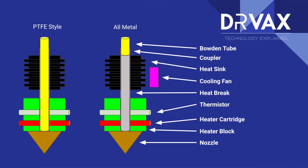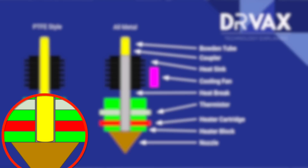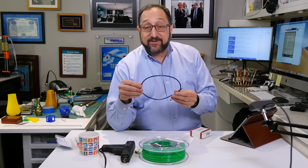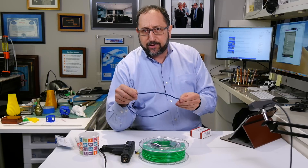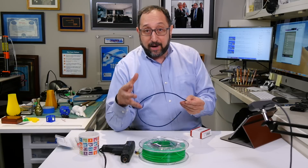There are two different styles of hot end. There's the PTFE style and the all-metal style. The PTFE style is the style used by most Creality printers — in that case, the Bowden tube goes all the way down to the nozzle. The challenge with that is if you don't press that Bowden tube all the way down and you leave a little gap, you're going to end up with melted filament between the end of the Bowden tube and the nozzle, causing a jam. The other problem with the PTFE version is that standard Bowden tubes are really only rated to about 230 degrees — they begin to give off gases you don't want to breathe above 230 degrees.